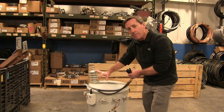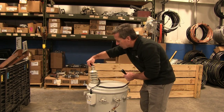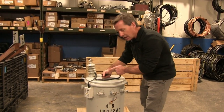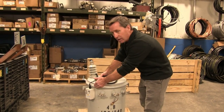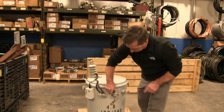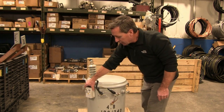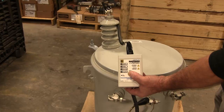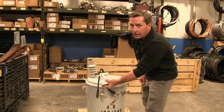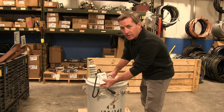On the single bushing primary coil side of your transformer, make one lead tight onto the top of the bushing. The second lead will go either to a tank ground or you can go on to your center bushing on your secondary side. Make that good connection on there. Now we're going to hold our button down for about four seconds. I've got transformer okay — I have passed that part of my test. The high side of my coil, my transformer is good.